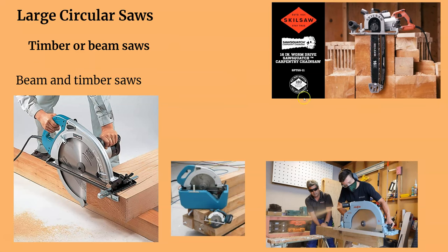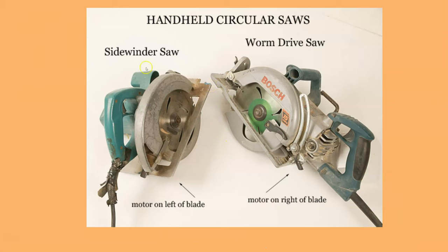There are all kinds of circular saws out there. There are beam saws that have a chainsaw-type blade you can use for really big stuff — timber saws with a 16¼-inch blade that can cut really big lumber like 6x6s in one shot. You've got to watch out when using those. This is a comparison: the sidewinder has the motor right next to it and is more popular in the eastern United States, while the worm drive is more popular in the western United States.